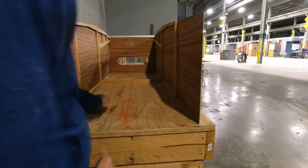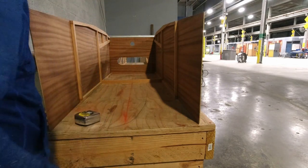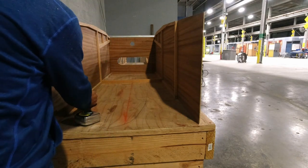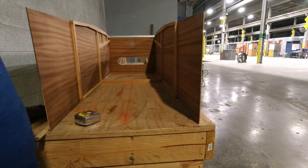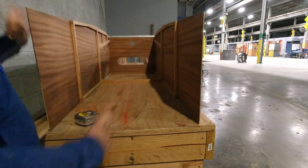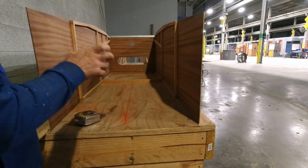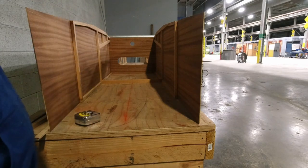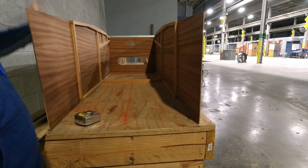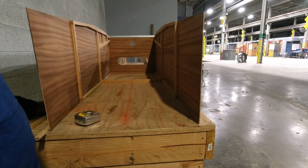So now I know I got a couple pin marks here. Whenever these longerons are against those pin marks, I know that these two are equidistant. They're lined up together, and then I can square everything up from there. And actually, when I go back and look behind the plywood where the lines are, where that particular station is, it's actually lining up perfect there, which is 90 degrees to the fence.